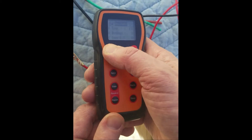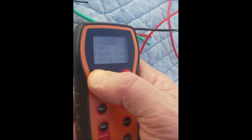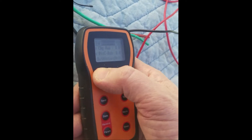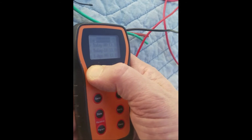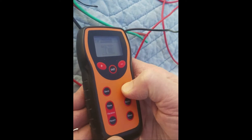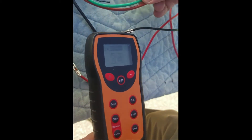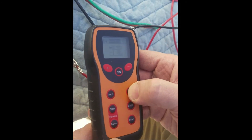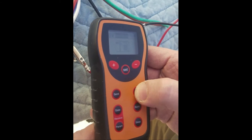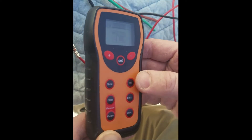You can scroll down by hitting the plus sign — that's going to show the temperature and all the other charging parameters. Right now it's showing there's no charging current going into the battery since there's no solar panel hooked up. You can also run through a test cycle — that'll have 100% output from these leads, and if you keep repeating that button it'll decrease: 70%, 50%, 30%, then 0%. So you can test the dimmer function on the power output from the load circuit on that charge controller.